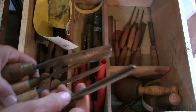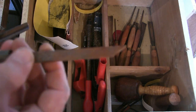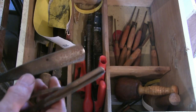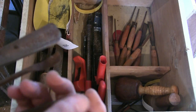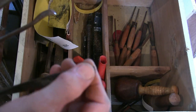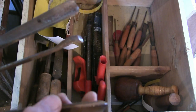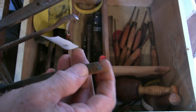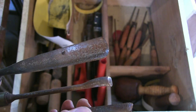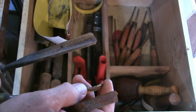Now one of the most important things - our actual carving chisels and carving tools. You'll see there are loads of different forms and shapes. Some you can actually make yourself from old chisels - for instance, this one's been made from an old chisel, just sharpened up the shape I want for paring into edges. Good chisels are not cheap, though you can get cheaper sets. The thing with chisels and gouges - they must be sharp. You need proper slip stones with oil to sharpen them. When the kit comes they won't normally be sharpened, so you've got to grind and sharpen them up.